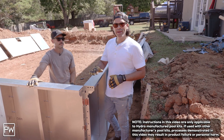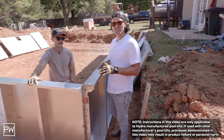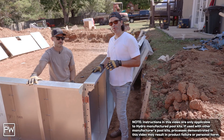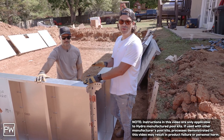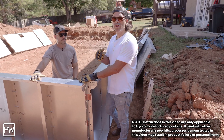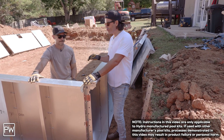We've gone ahead and got our panel shelf set, and that's what the panels are sitting on — all level. We've tamped it down in spots that were high, and you definitely want to make sure that you're using a level and you're plumbing your panels before you permanently set them. We're not ready for that quite yet, but we are ready to start putting our corners together.